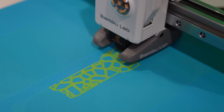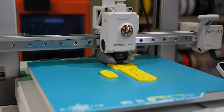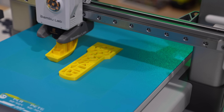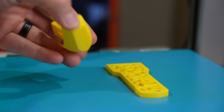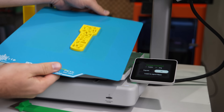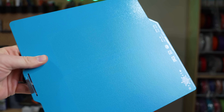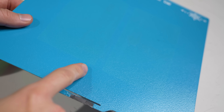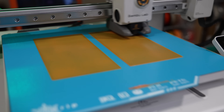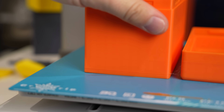The next day, I reset all parameters I'd changed, set the bed to 40°C, and printed out a spatula and benchy side-by-side. The first layer on these parts looked much better, and both completed without any issues. Adhesion with PLA on this plate is very strong — while I was able to pull the benchy off, there was no budging from the spatula. Luckily it's a flex plate, so flexing it allowed me to pop it right off. One thing I noticed was that I could see an impression of the print on the plate after it was removed, and even a bit of color left behind. So far it doesn't seem to affect performance, but I do wonder over time if it will eventually affect its adhesion.